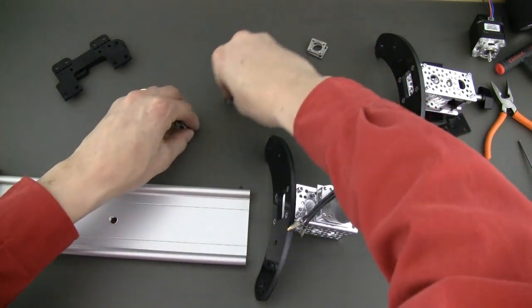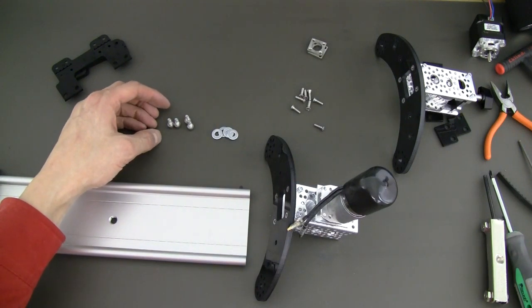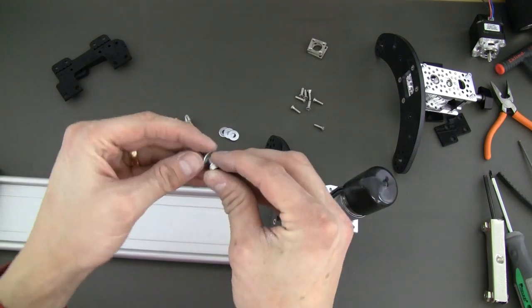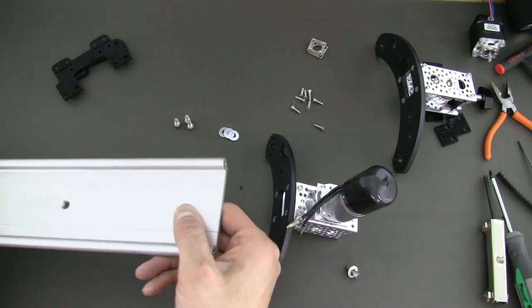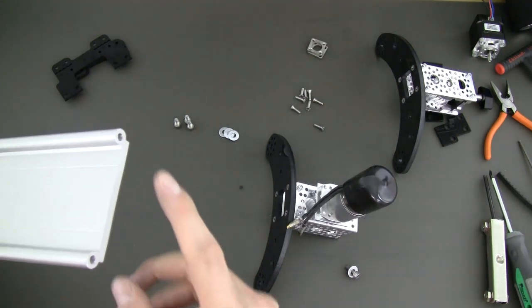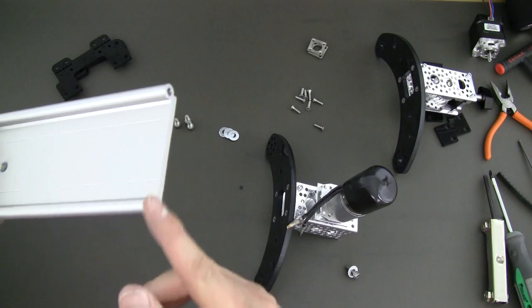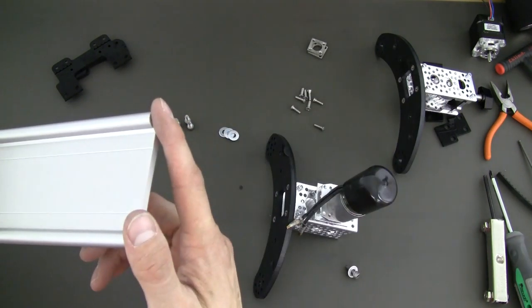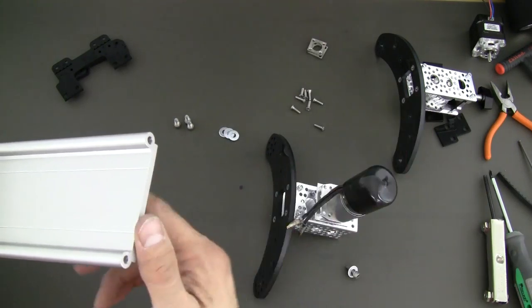What we want to do now is grab — you should have in your kit four 10-24 socket head cap screws. I'm going to go ahead and put the number 10 washers on. You should have an IGUS B version, 1080B, which is going to have the tapped holes. If you have the A version and your holes are not tapped, we'd highly recommend that you tap them, as this will make the whole assembly much easier and actually make it work.